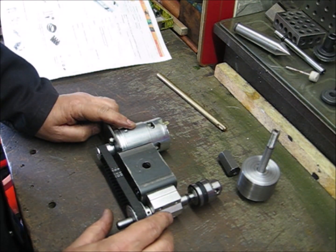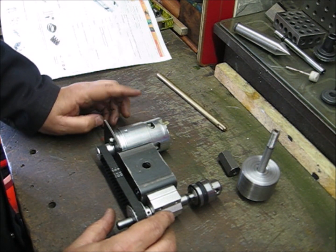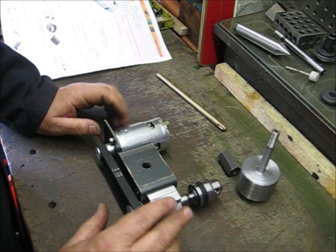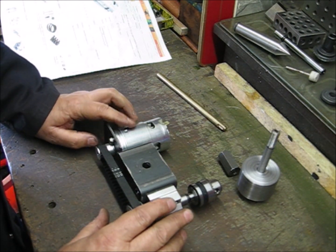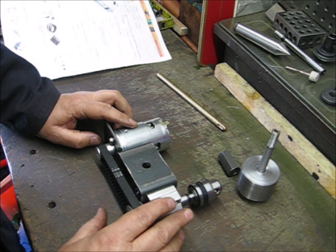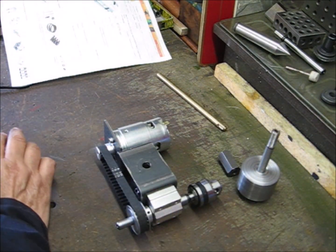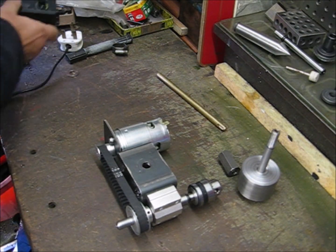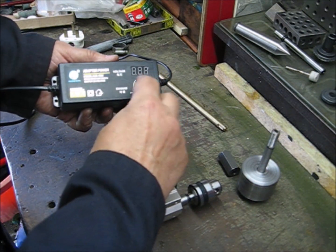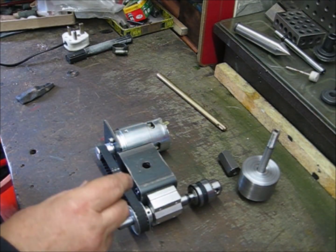The motor I've used in this case is a 895 motor. You can use a 775 and there's another one you can use — they come in various specs, so when you're buying them just make sure you know what you're buying. This one's got a 12 to 24 volt range. I use it with this variable power pack here, which goes from about 2 volts down to about 24 volts, so with it connected to that I've got a fair range of speed adjustment.